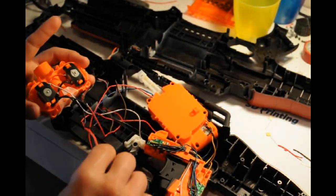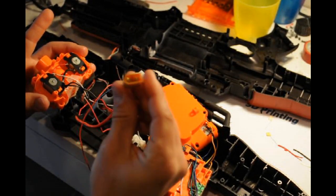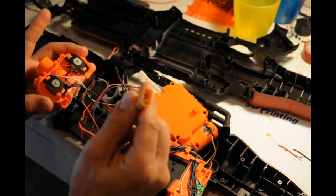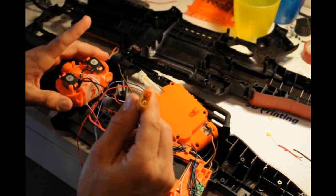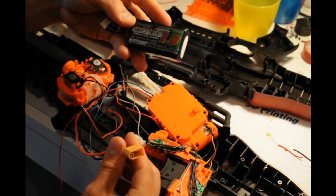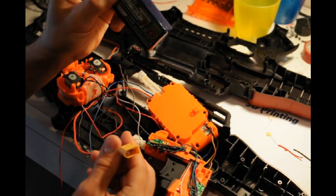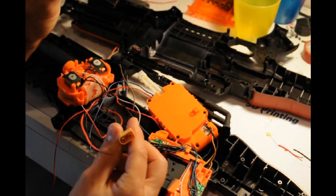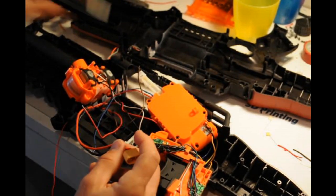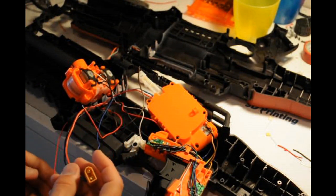So what I did right here is I tapped into it as well and put a new connector. I'll try and remember to put the link in the description of where to get this thick gauge wiring and these male-female connectors for your lipo battery. And I put that in instead. And then one of these Turnigy 11.1 lipo packs, I modified the end of the connector as well here, and put the male connector here, female connector here, and that's ready to go to ramp up the power a whole lot. Hence this, working together with removing all these resistors, gives it way more power, which when I demo it, you guys will see that.